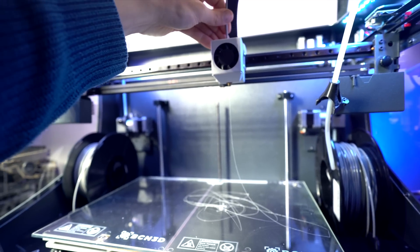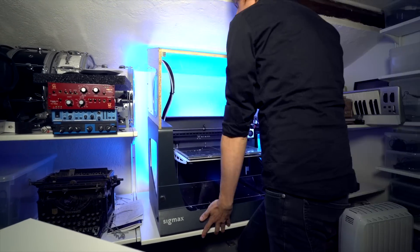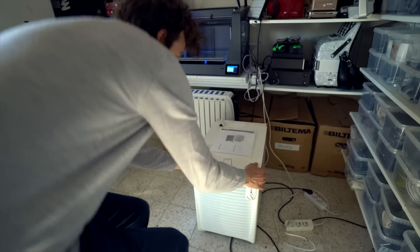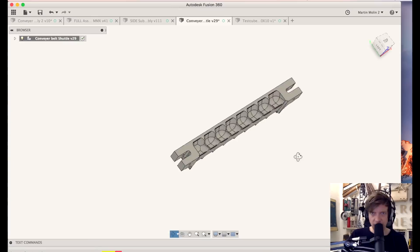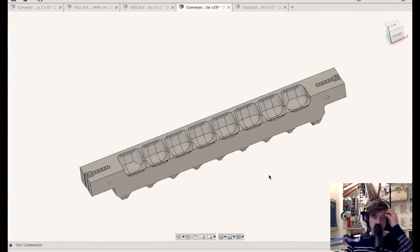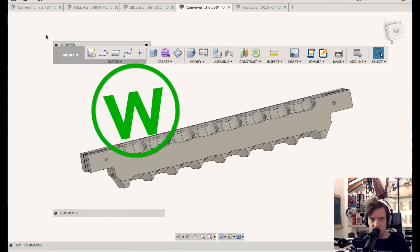I fixed the right nozzle when I clogged it up with a guitar string. I built a heat enclosure to prevent warping as you could see. I installed a huge dehumidifier in my print room. I installed some shims under the hot end to get accurate results in duplication mode. And then I went into Fusion and redesigned my piece to better suit 3D printing — better print direction and so on.